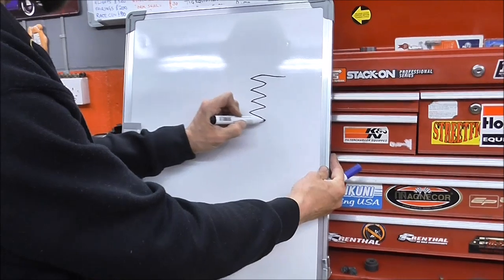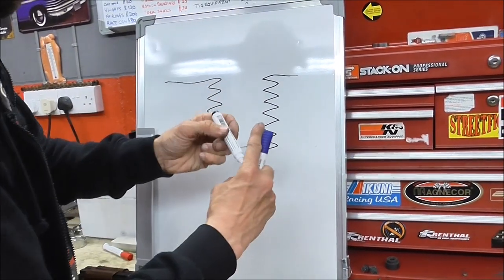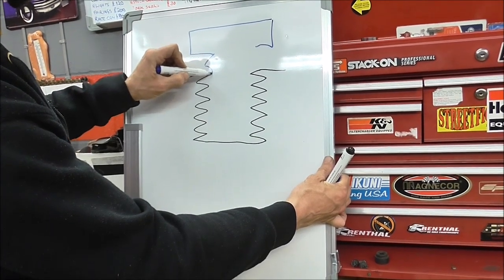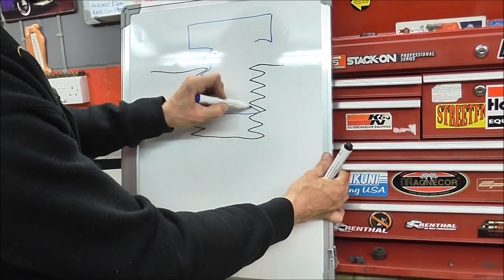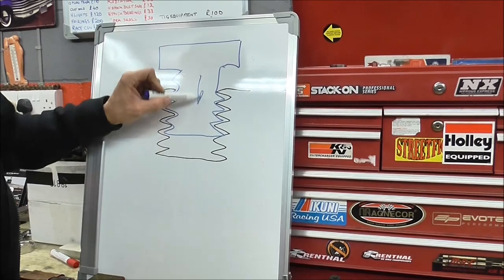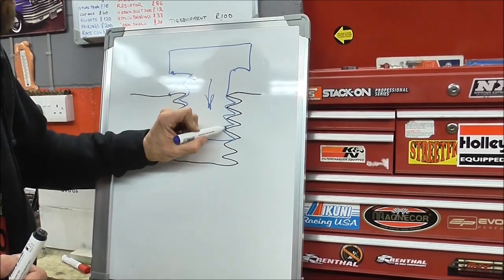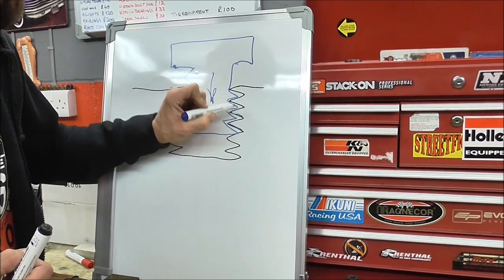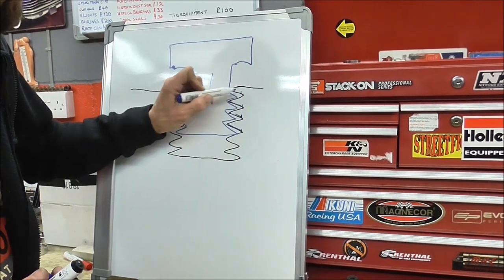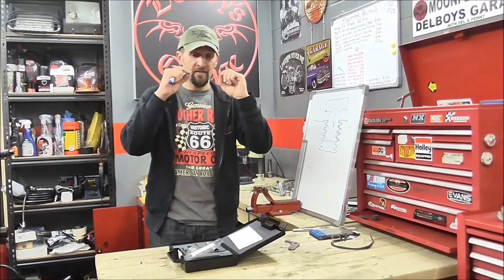If we take a standard hole, and we'll assume that is the thread — not very to scale. So we'll take a blown up cross section, a rough drawing of a blind hole with a thread in it — a blind hole because it doesn't go right through. And this is the bolt, it comes down like that, follows down inside. Now, simply what happens is when you do that up too tight, that motion stops because it meets the bottom and it's done up. People keep leaning on it and it can't go that way anymore, so it starts applying loads of pressure to these surfaces here. What that does over time is cause micro fractures in the threads — little tiny micro fractures. It stretches the thread. That doesn't literally mean stretching the bolt; what it means is those little tiny teeth inside just get damaged, just a little bit.